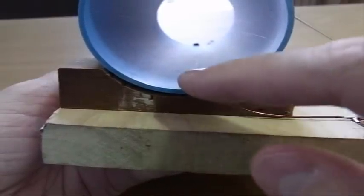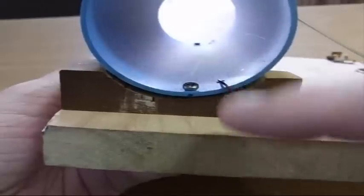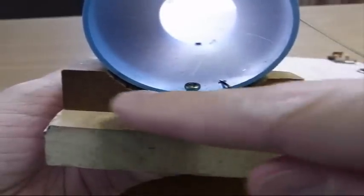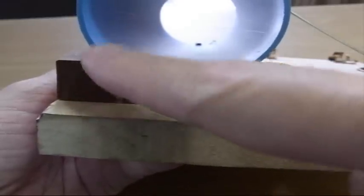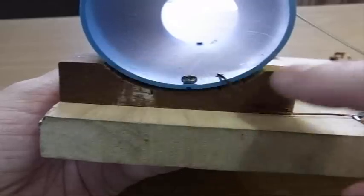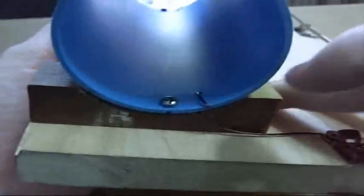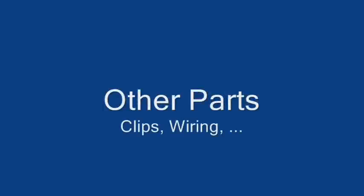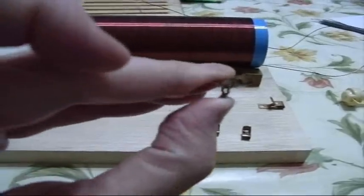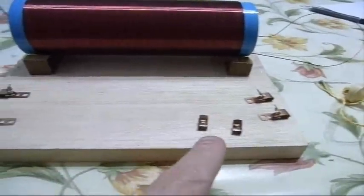Most of these radios have just a screw from the coil to the bottom base piece, with a few washers to space it, because you do not want the coil to touch the base. I made this little block — it's kind of crude, but I sawed it into roughly the shape of the tube, then chiseled it out and used a rasp. It's fastened on the bottom with a couple of screws and fastened to the coil with one screw on each side.